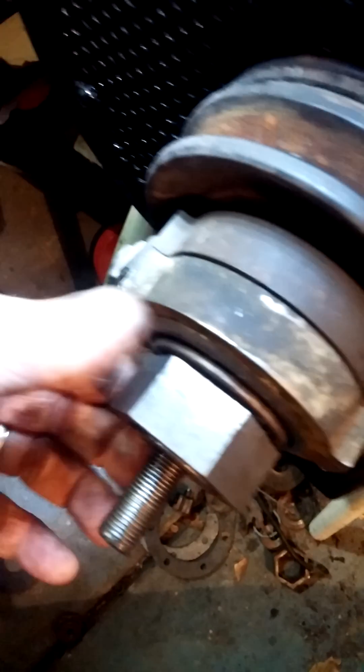Here's the trick: leave this a little bit away from here. Take the nut - the one that's got the ridge for the shoulder in there. Clean this up inside so it's perfect, then put a tiny bit of grease in there. When you put this on over that nut, it will create a little bit... see, if it's too far there's no edge. So you back it off just a little bit and slide it back - see how there's a tiny bit of an edge there?